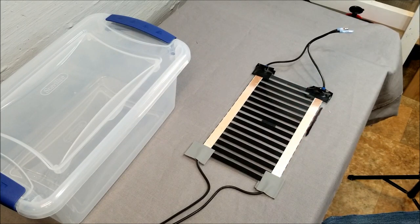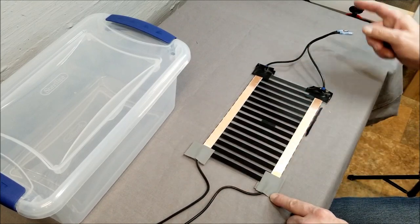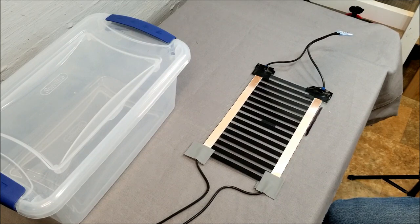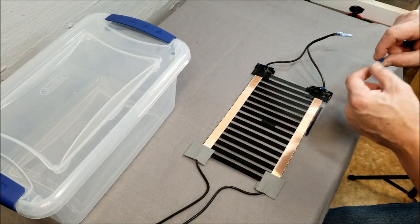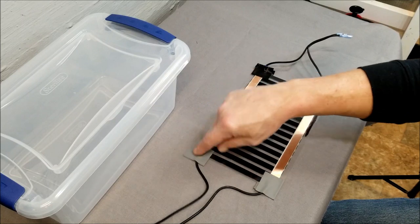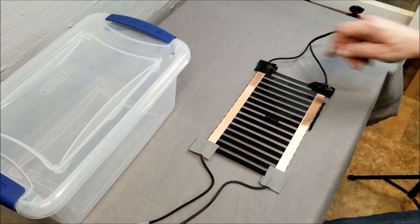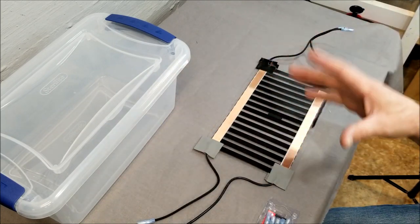Here's how I got it connected — at two ends. I'm going to connect another piece of heat tape for the lid. I have a separate video that shows how to hook these up. Basically you use eyelets: punch a hole where needed, slide the eyelet in, and squish it together to hold. I'll put that video link in the description. I do have it connected both ways using these connector ends, and the reason I use them is so I can take it apart easily for cleaning.